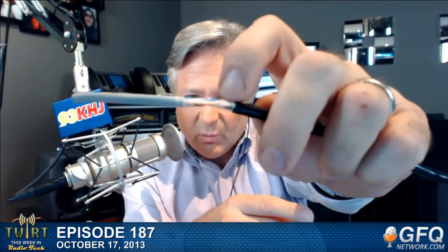Just score it a little bit, and it's actually kind of tough. That's what makes this outdoor cable, I suppose. The squirrels and the chipmunks. That's for a moisture barrier and what else? There's a few things. Yeah, I bet it is a moisture barrier. I should point out that typically the insulation that's on the conductors, on the wires themselves, is typically pretty soft. It's easy to nick. And so you want to try hard not to nick those pieces of insulation.